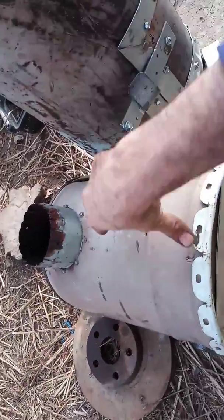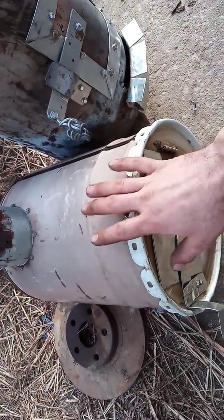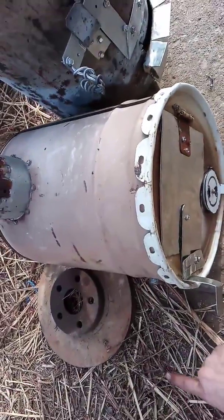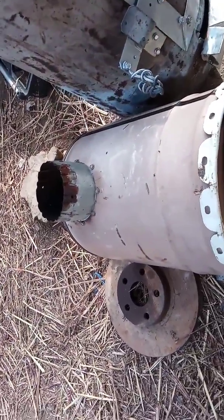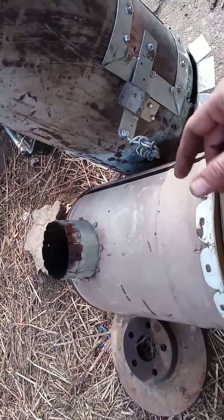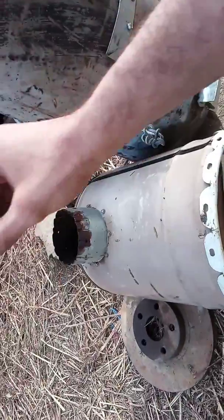But I'm also thinking about repurposing this one into a water heating stove, where you coil copper pipe around it and leave an outlet at the top and an inlet at the bottom. If your water basin sits above your heat source, where the water runs down into the copper coil, it will create its own thermal reaction that will pump the water back up to the basin. You want your inlet for the hot to be about center mass, maybe slightly above. It creates its own thermal barriers. The cold water runs out from the bottom, dumping the hot water back in at the top, and from three-quarters up, the whole thing should be hot water.